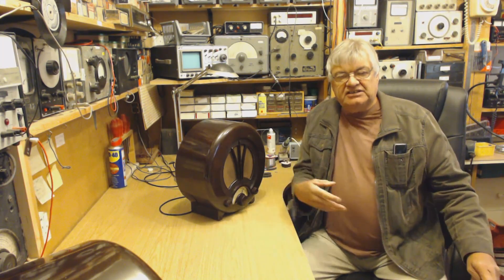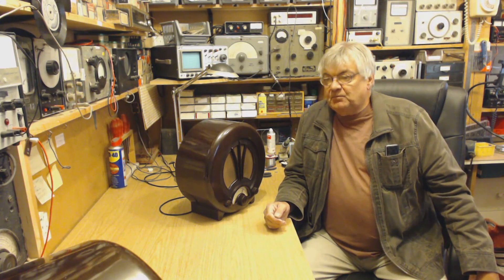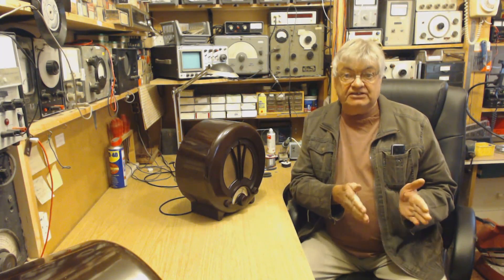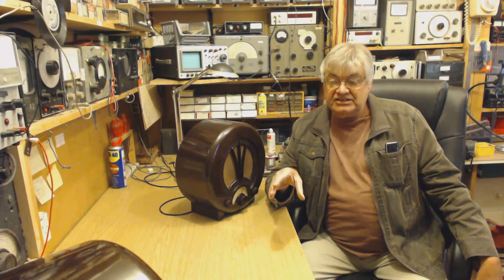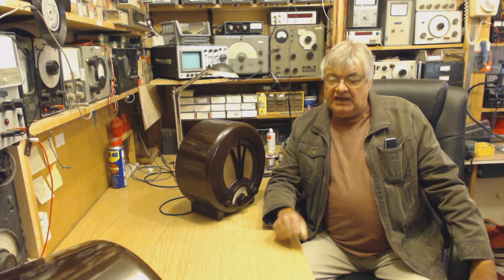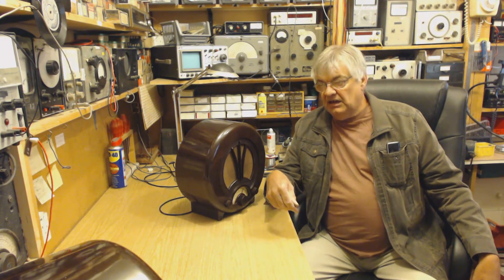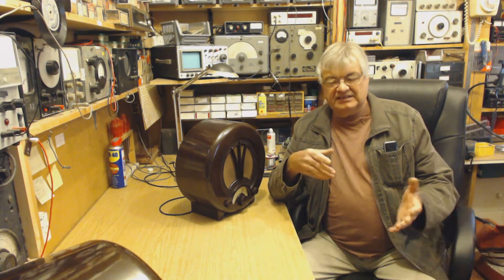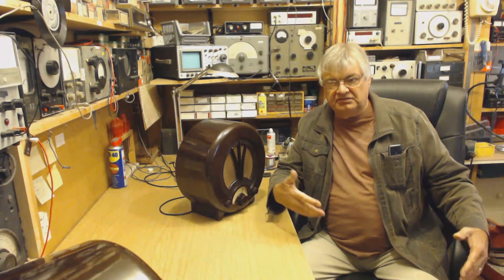I don't know what it is. It's unfortunate because it basically covers most of the medium wave band. Shortwave — the amateur bands: 160 metres that's 1.8 MHz, 80 metres 3.5 MHz, 40 metres 7 MHz isn't too bad. It fades off at 7.5 MHz so 40 metres is usable, and up in frequency is okay. But it is dreadful even on sideband — the S-meter is still S9. It's not a series of carrier waves or anything like that, it's just a sort of blanket all the time.